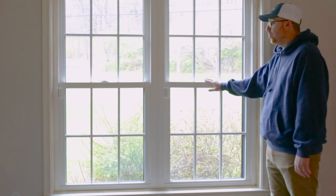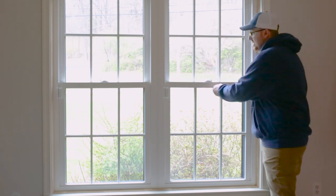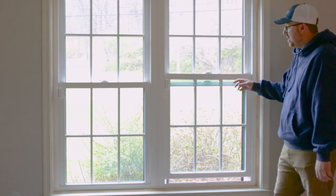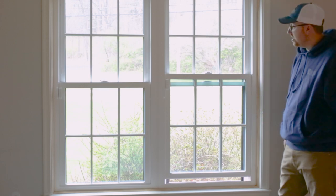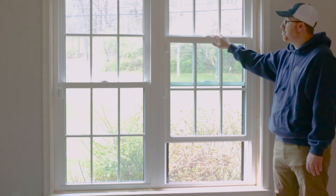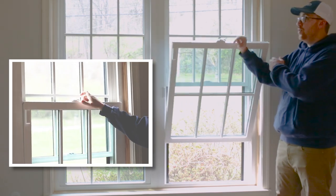So obviously you want to unlock the window, and then the next thing you want to do is slide the sash up and make sure you clear the sill down here. A lot of people try to unlock the window and then tilt it in right away and you don't have the clearance that you need. So you slide the window up — there's a patented tilt and lock that is standard on Cambridge and S-series hung windows, so there are no tilt latches. You just push the lock in and that'll tilt the whole sash in.